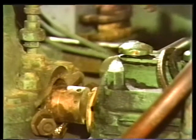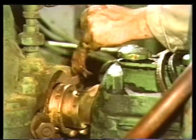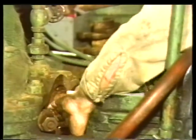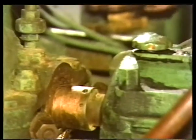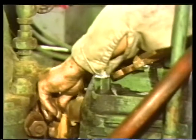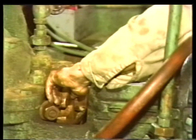When the first rings of packing are in position and properly staggered, lubricate the outside of the lantern ring. Then slide it as far as you can into the stuffing box. You can now lubricate and install the remaining new packing rings outboard of the lantern ring. When the last ring is in position, reassemble the gland follower on the shaft. When you have both halves fitted together, use the follower to push the packing rings and the lantern ring into the stuffing box.